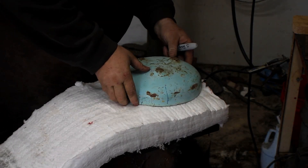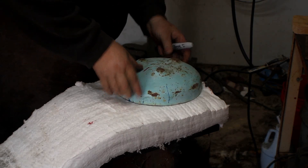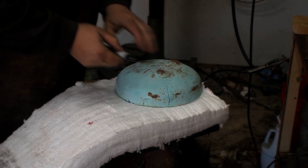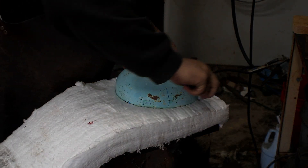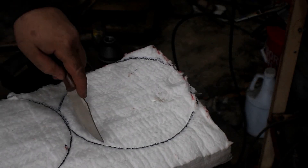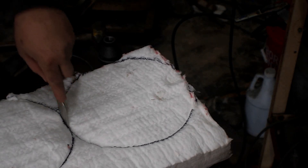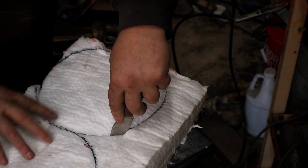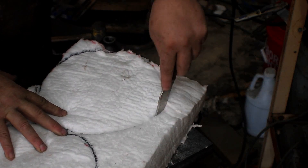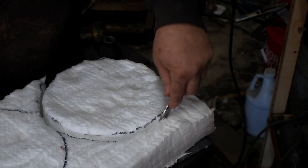This stuff is spun ceramic wool insulation, specifically made for furnaces, stoves, and foundry furnaces. It is 2 inches thick — that's all I use, I don't use anything thinner than that. Otherwise you take a chance of overheating and really destroying your forge. I use 2 inches and I've never had a problem with it. It's really good stuff. It cuts easily with a knife — sharp or dull — and you can also cut it with a pair of scissors or shears.